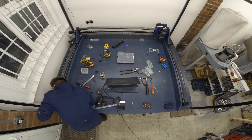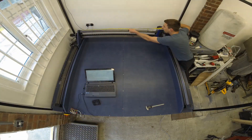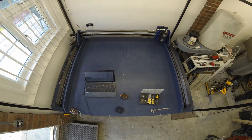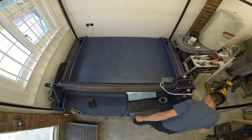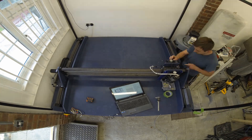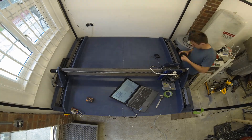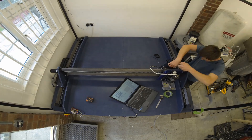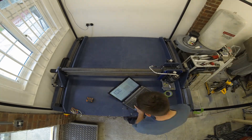For an added bit of bling, you can install some LED strip lighting on the axis. There is enough clearance between the bearing blocks to install a standard width LED strip — just be sure to get the silicone-shielded type to stop any swarf or debris killing the strips. To control the LED strips I used a MOSFET pin on the Arduino RAMPS board to turn them on and off, control the brightness, and get a visual indication of when the machine is running.